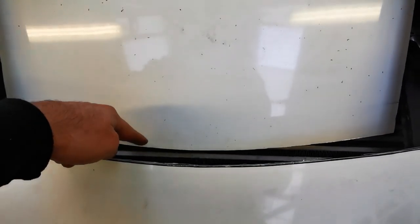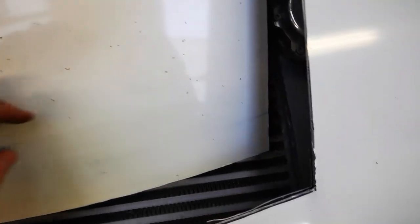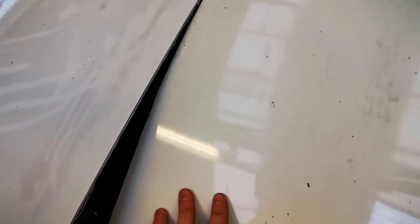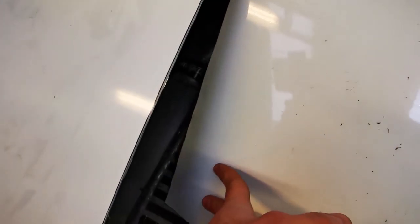Pretty happy with that — it came out all right considering we used the precision grinder. What we have to do now is chop this piece, make it flat so that when we push it down it'll meet the edge of the intercooler. We're also going to have to bend it at about this point because that's where the turbo sits. If you push it down now it's hitting the turbo, so we'll start the bend there and then meet up with the intercooler.